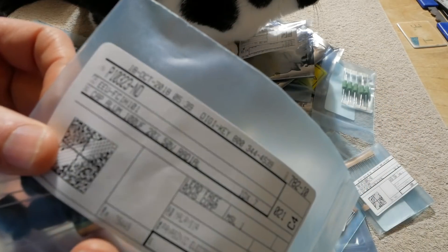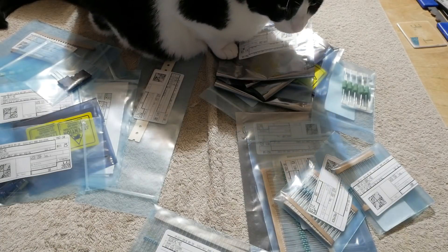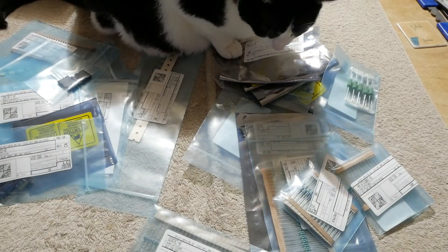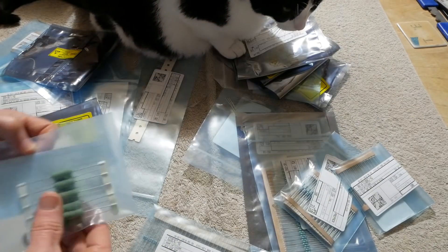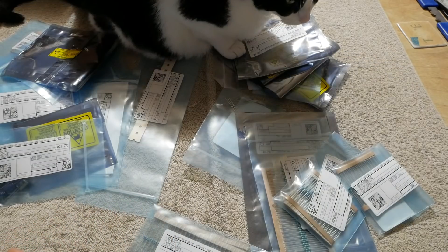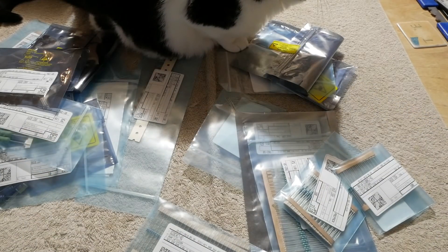More capacitors — electrolytics, 100 microfarad. I'm trying to minimize the use of these in the amp. Of course they'll be decoupling across the rail along with film or ceramic caps, but there'll be a couple other places in the amplifier that use them. So there are only going to be 4 in the entire board. I also got BD139s and BD140s, which will make driver transistors. And emitter resistors on the outputs: 5 watt, 0.22 ohm ceramic type resistors.